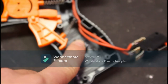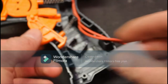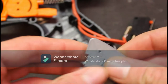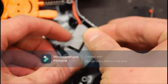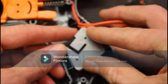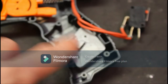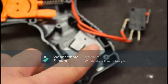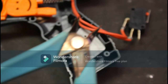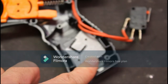You need to remove the stock switch that sits inside of this little square here. You will have to trim down this little square — the best way to do that is to remove your stock rev trigger, set your switch plate into that square like so, then take a sharpie and mark all the edges where it sticks above the surface. Then take your side cutters or wire snips and trim all the plastic until it is flush with the switch plate.